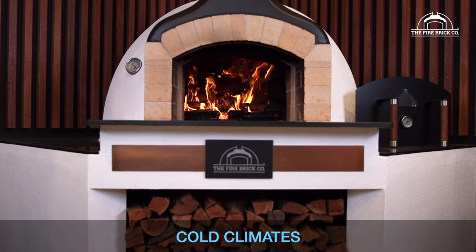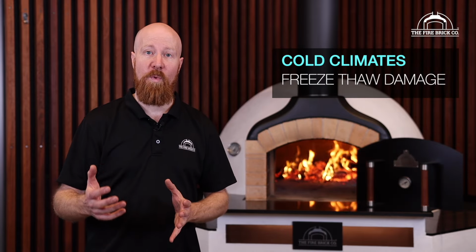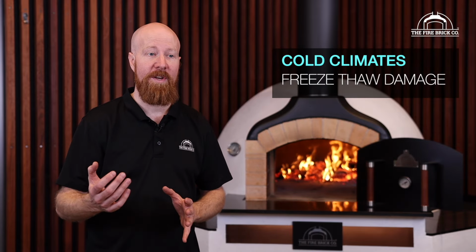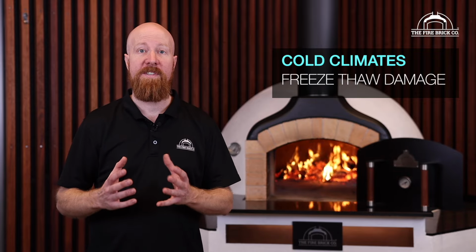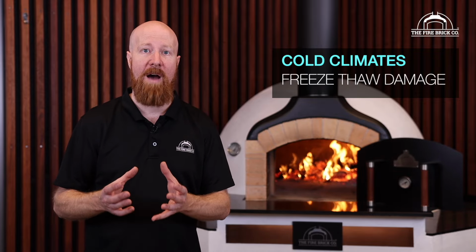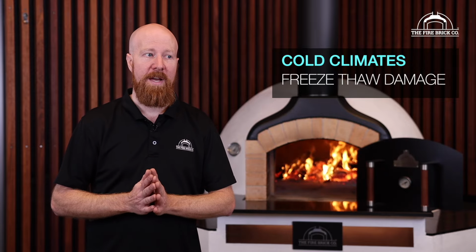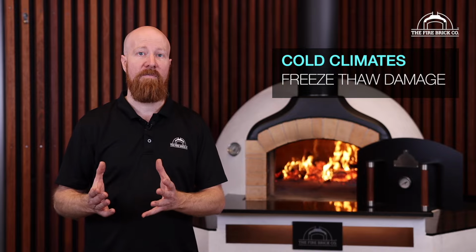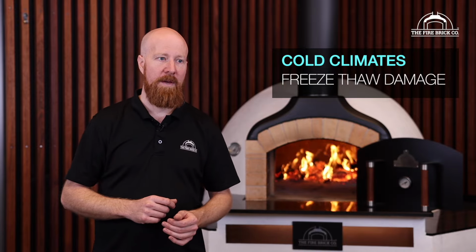If you live in a cold climate, I'm pretty confident you've already figured out the thing that you need to think about, and that is freezing. If you go into winter and your oven is holding water, that water is going to freeze and expand, and that's going to cause some very serious cracking and damage to your oven, which is just something that we really want you to avoid. Okay, so there is a rule that we have for people building an oven in a cold climate, and it might not be what you think.